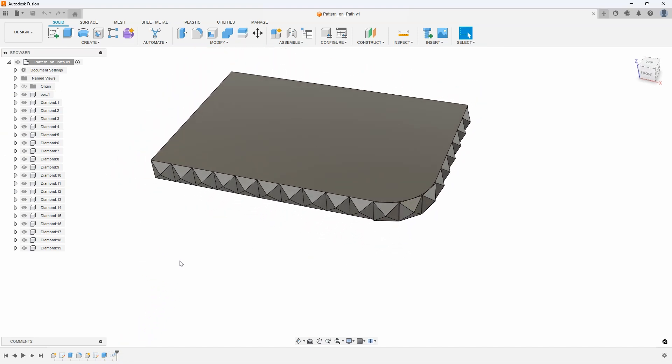The solution that Martin recommended was using the sheet metal functionality. You might be thinking, wait, what? But this is actually a really cool trick. I use this quite a bit — I've used it for simulating flex circuits for electronics. If I want to create a complex shape that follows a complex profile, I can use sheet metal to unfold, create the pattern I want, and then fold it back. That's what I'm going to show you here.